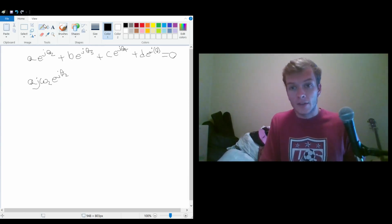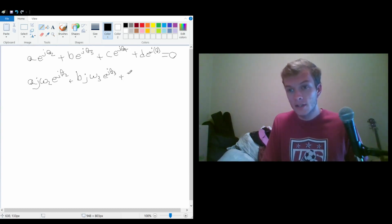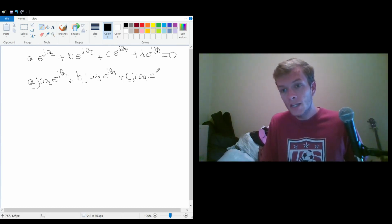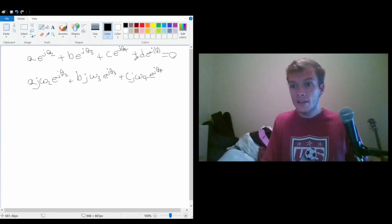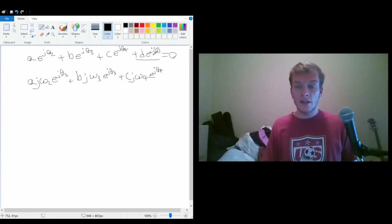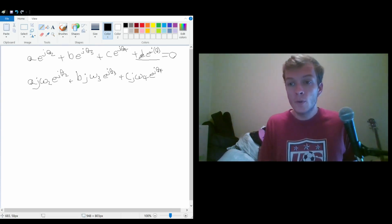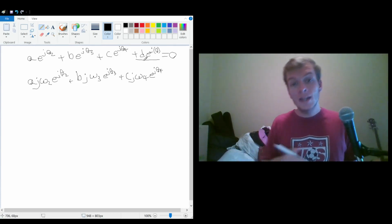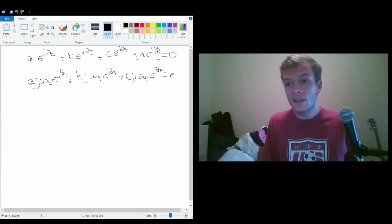So that's one term, plus b j omega 3 e to the j theta 3, plus c j omega 4 e to the j theta 4. And this last term is completely constant. Like I said, nothing is changing in length here. So the derivative of d is 0. The derivative of e to the j 0, which is 1, is 0. So we don't have anything else in this equation.